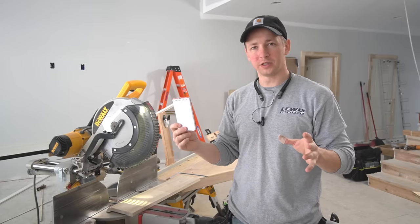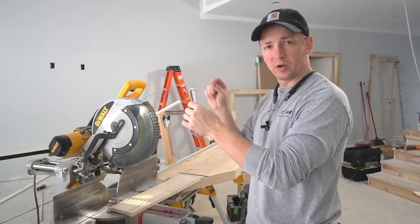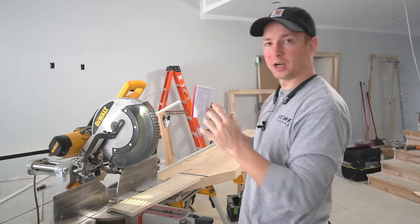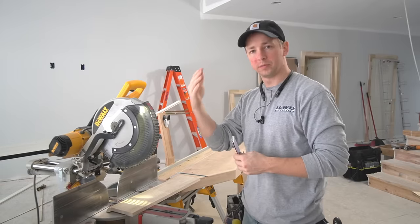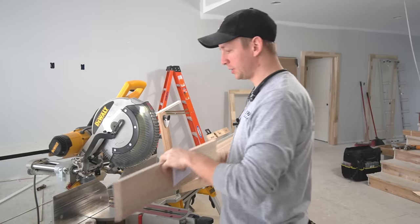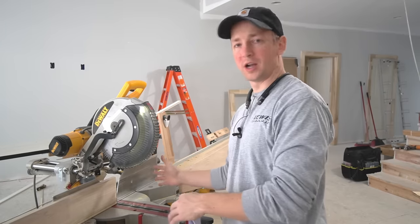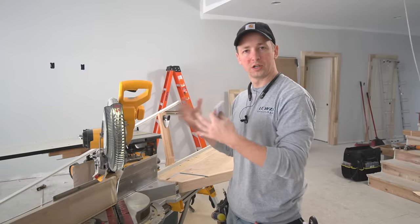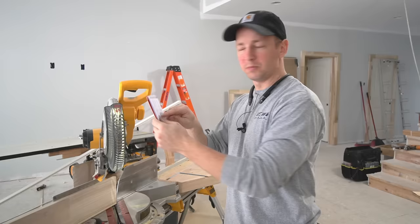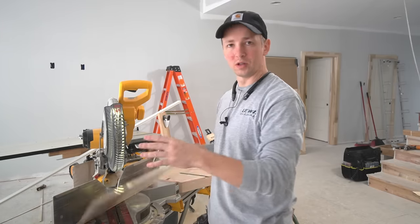One more piece of information: since we're going to be going clockwise around our room taking measurements, I'm noting which side of the board is going to have my straight cut and which side is going to have my cope. As I go around clockwise, my cope — the C on my cut list — is going to be on the left side of my number. If you're cutting your material upside down, everything switches and becomes opposite. So on my cut list, if I turn my baseboard upside down when making my cut, if I have a C on the left side of the number, that's actually on the right side of my board as I cut it upside down on the miter saw. Just remember: whenever you're cutting upside down, everything is opposite. If it's upside down, it's opposite.